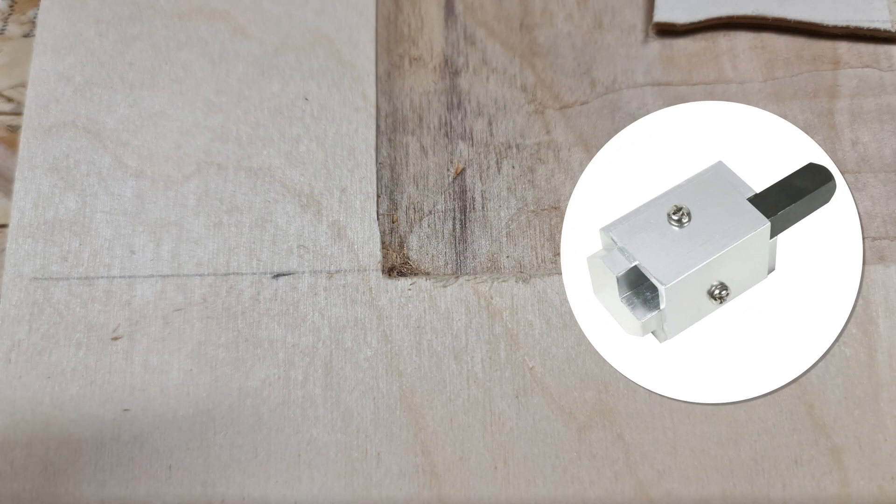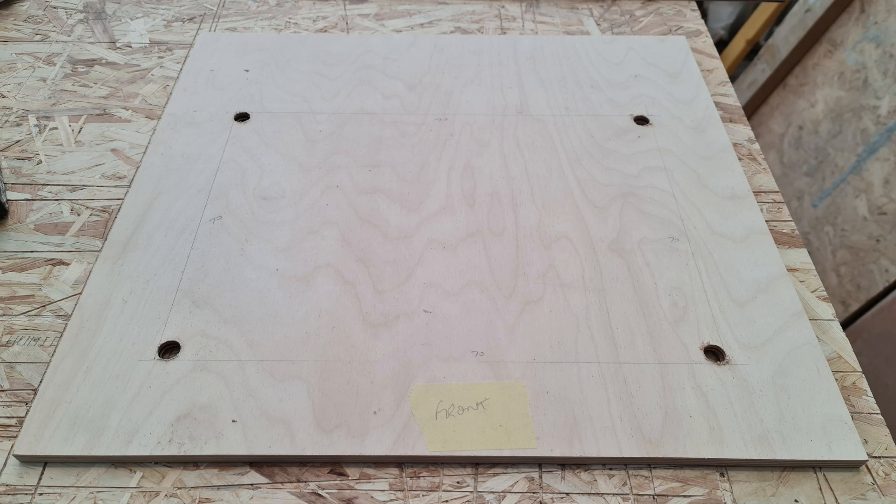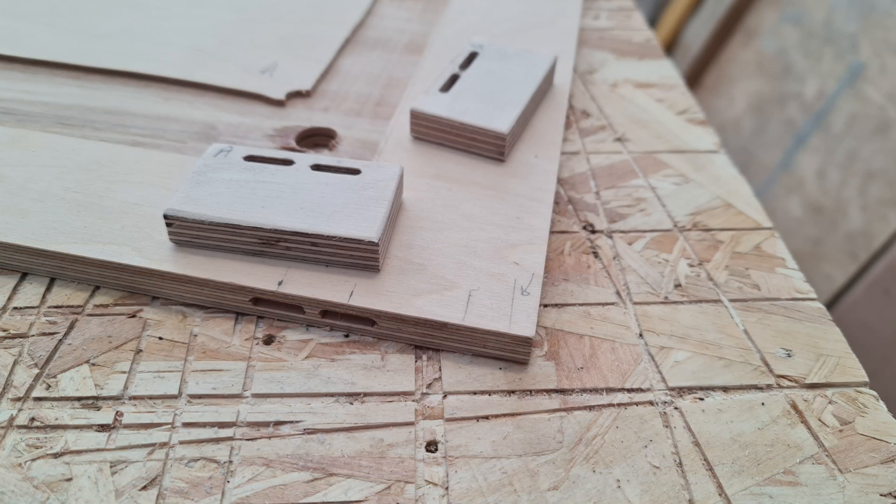I used a corner chisel to sharpen the corners. Turning the board over, I drilled pilot holes and followed up with a 20mm Forstner bit to give me a radiused corner. At that point I realised it would be handy to domino on some little rectangles to locate the front of the top, so I made them whilst the top panel was still intact.